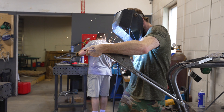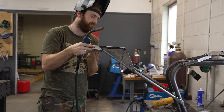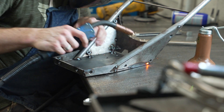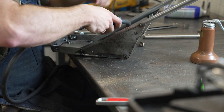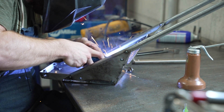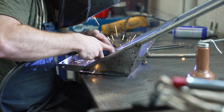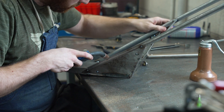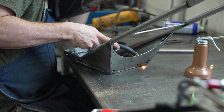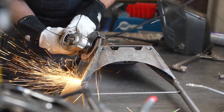It's a satisfying thing to start with paper templates and have it all perfectly line up. Got everything tacked together — that was pretty much the end of the hard work. Just needed to unbolt it off the bike, put it on the bench, get all the final welds done, and then everything cleaned up. With all the grooving, it can have a tendency to round corners over instead of being nice and sharp like you'd expect from a sheet metal assembly. But a little extra time getting that weld built up on the corner and grinding everything flat and smooth can help with that. In the end, I'm very happy with how it came out — I think it looks great.